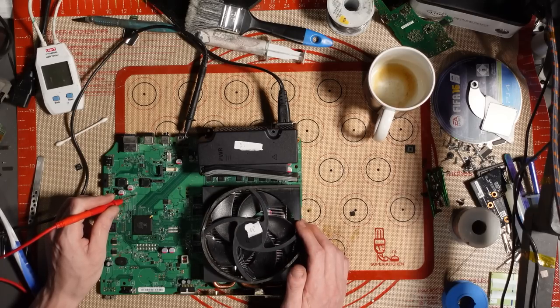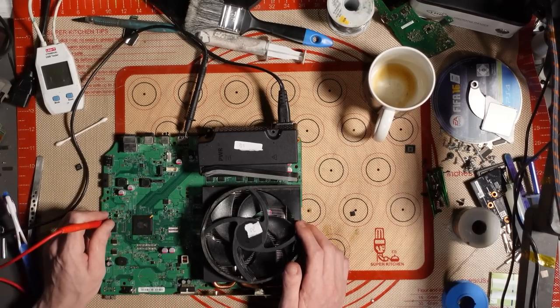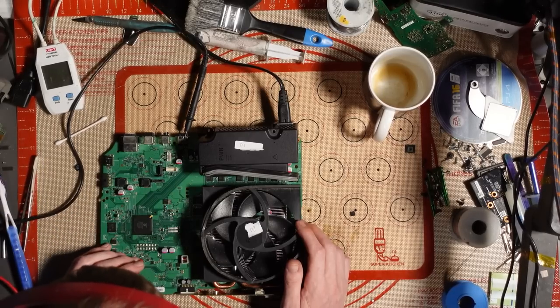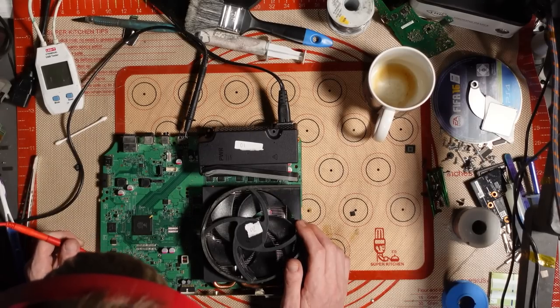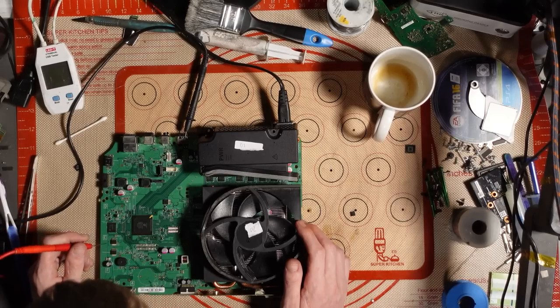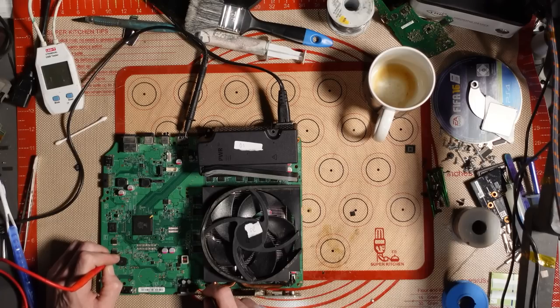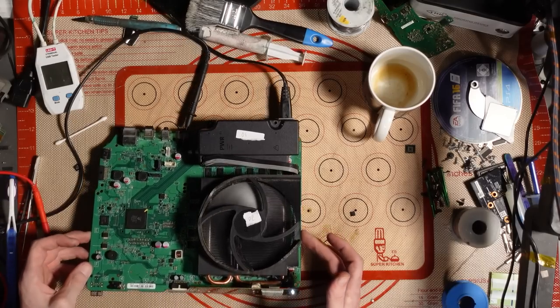I got my 3.3. So I got my 5, I got my 3.3. I got my 1.8 standby. I got my 1.1 standby. A 3.3 there. That damage power button isn't shorted, does it? No, it's not the power button. 5 volt on the RAM controller. I'll check that in a minute. Pin 12, isn't it? That's the one that pops open circuit. That's staying. Okay. No, it's staying.